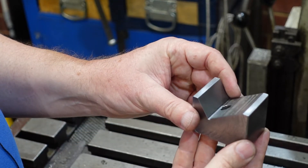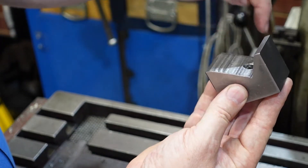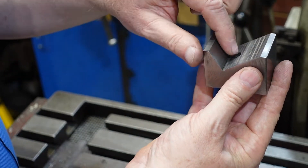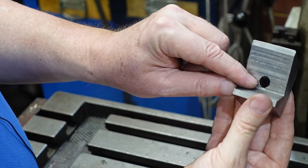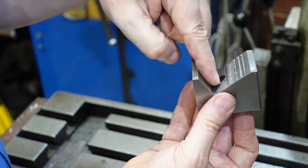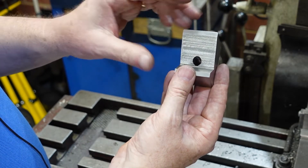I finished my support block. Basically I held the block in the vise to clear out the slot with a milling cutter, held it to run a slitting saw through to clearance the radius in the bottom of the cutter, then spot faced and drilled a hole through for the broach to go through. That's a three-eighth hole, which gives clearance to a quarter inch broach — as large as I'll be running through here. I set it back a little bit because I can always trim a bit off the end if needed, but that at least gives me an option.